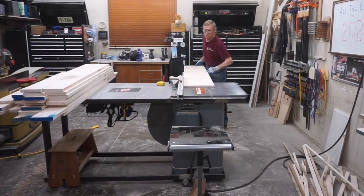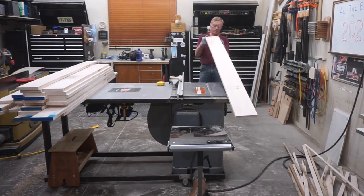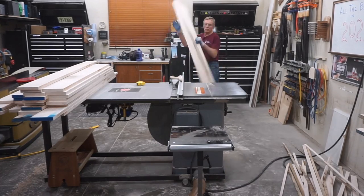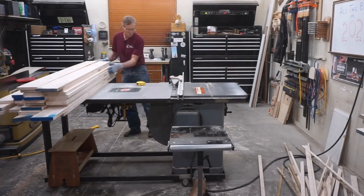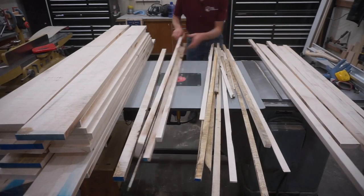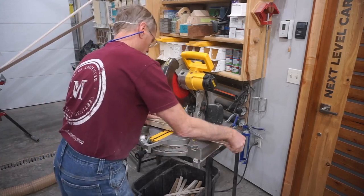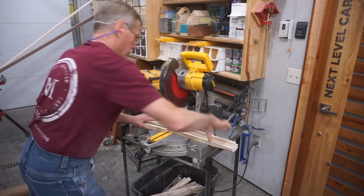As I near the end of the rough ripping process, you can see that some of the boards are more than twice as wide as the five and a half inch strips I'm cutting. So I first trim off the uneven edge from the second half of the piece so that I end up with a five and a half inch strip and a clean offcut I can make use of later. Once I finish the rough ripping process, I sort through the offcuts to separate useful pieces from scrap, cut the scrap into short pieces at the miter saw to keep offcut clutter to a minimum, and keep the shop environment organized for safety.